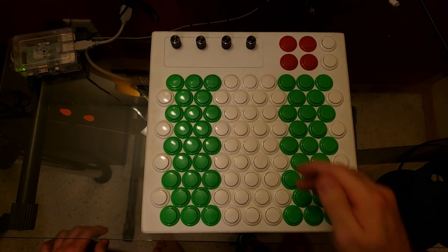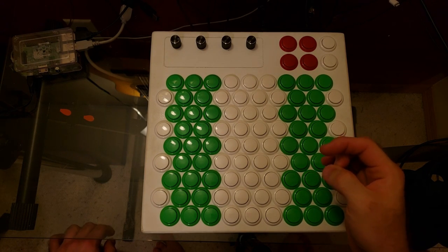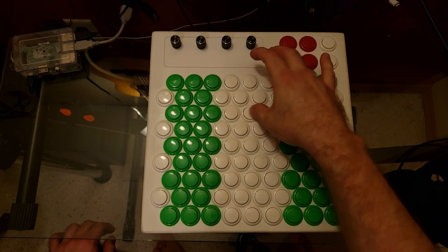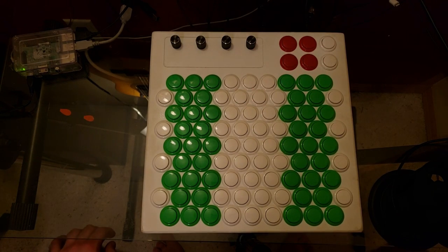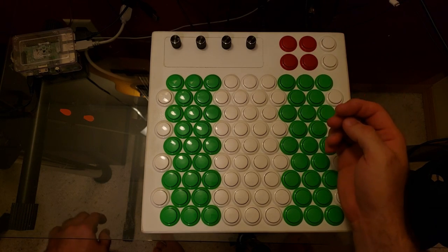And because we only have 85 buttons and the general MIDI standard includes 128 instrument patches, the remaining patches wrap around the top. Which brings us to maybe the first kind of unique feature, which is the ability to select an additional instrument on a second layer channel that we can play simultaneously with the main.